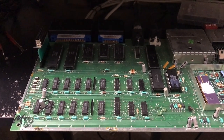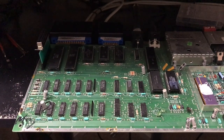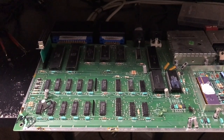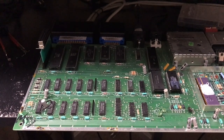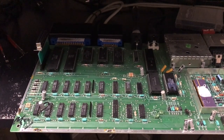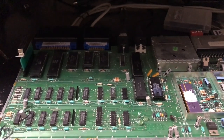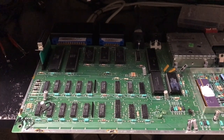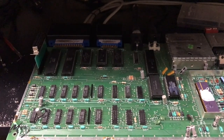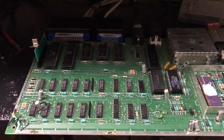A lot of people shun these boards because they only have composite video output, but with a couple fairly easy modifications they can be turned into a perfectly serviceable C64. That's part of my goal with these videos — to basically clear their name, so to speak. I'd like to see more people use these machines because there's still a lot of them around. A couple easy modifications — a resistor here or there, change a couple capacitors — and you could have a really solid, good running machine. Let's start putting this thing back together and finish up the video.